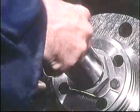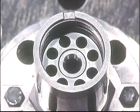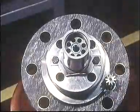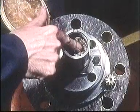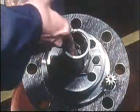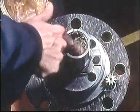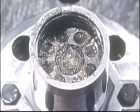A damaged suction valve seat can be ground with the aid of the grinding mandrel supplied. Before grinding, all the openings in the seat are to be filled with Vaseline to prevent grinding paste from entering the ducts. The valve seat is ground with carborundum number 500.